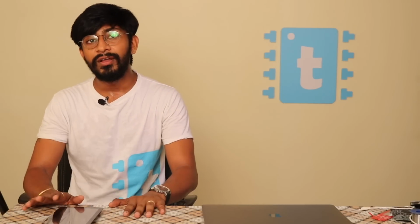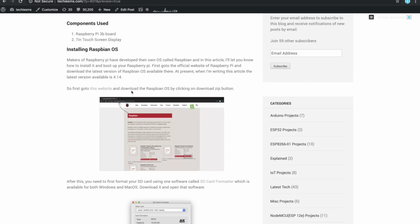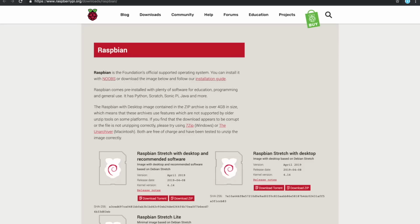First of all, for those who haven't used the Raspbian OS on your Raspberry Pi, I'll quickly let you know how to boot up your Raspberry Pi board with the Raspbian OS. I've written an article where I explain how to install the Raspbian OS as well as how to interface this touchscreen display. I will attach its link in the description. To install Raspbian OS you need to go to the official Raspberry Pi website, whose link I have attached here, and you can download the latest version of Raspbian OS with the desktop from there.